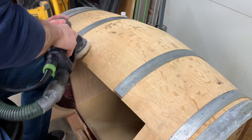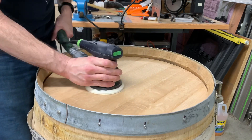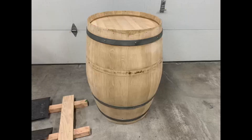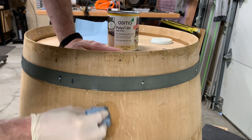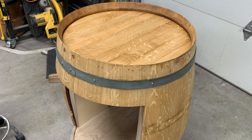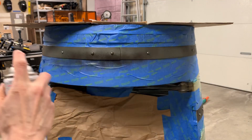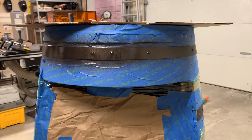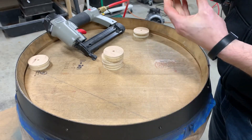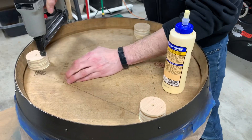I did this a little backwards — I did the entire finishing of the outside part of the barrel before I made the insert for the inside. One by one, I removed each ring so I could sand underneath it. It wasn't necessarily important that the area underneath the ring be sanded, but I wanted the sanding to be as even as possible. I finished all the wood surfaces with Osmo Polyx oil. I edge primed and edge painted all the rings while they were off the barrel. The final painting was done with the rings installed and lots of masking — for the color, I used an oil rubbed bronze paint from Krylon. I also took a moment and added some leveling feet to the bottom, because this barrel is pretty heavy and it might end up on hardwood floors someday, and I wouldn't want to scratch the floor with that metal ring on the bottom.